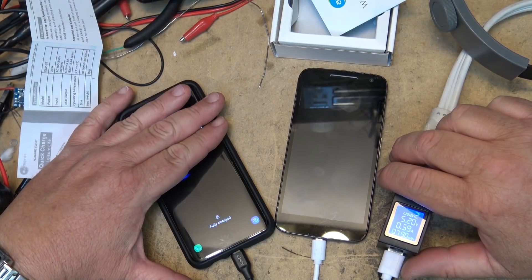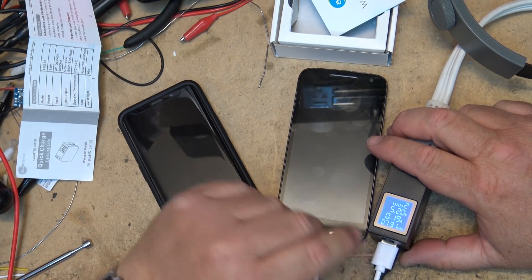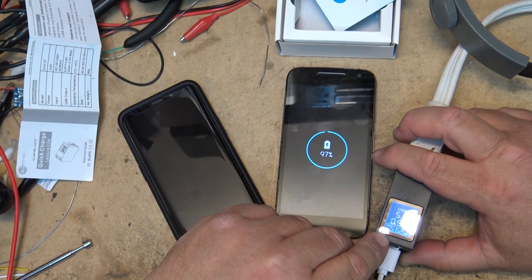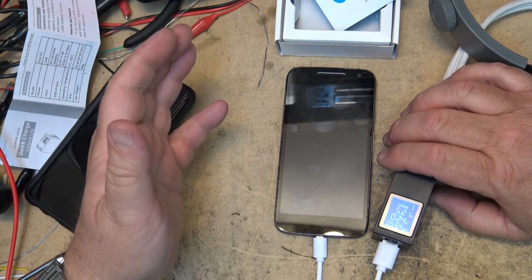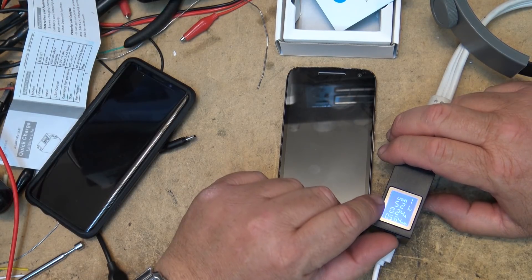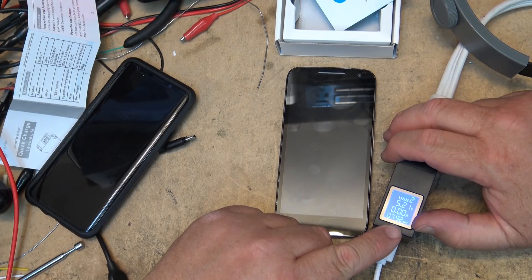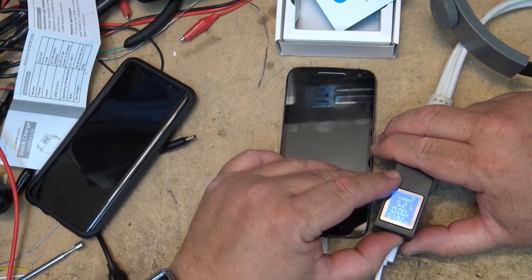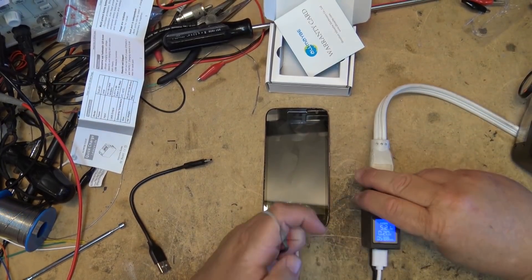The Motorola is now fully charged — it took 791 milliamp-hours and current is down to 0.19 amps as it's gone into sleep mode. The Samsung is at 97% after 51 minutes, drawing 0.34 amps. Port one now shows zero amps since it's unplugged, but still shows 792 milliamp-hours. To reset the counter, press the button twice. Now I can charge another device and measure exactly how much power goes into it.